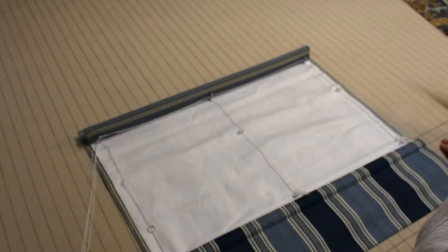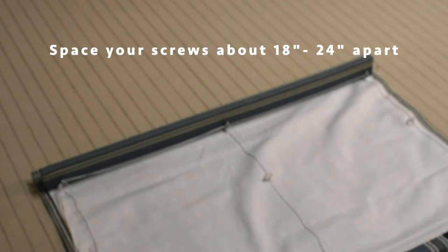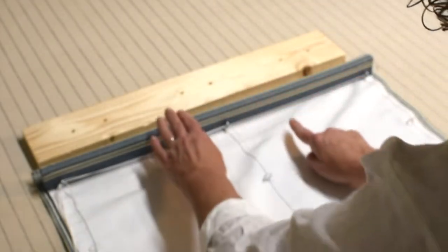Now if you're going to inside mount your shade, this is the easiest installation that you can do. Here's what the back of your shade should look like. We're going to be putting screws through the board right up into the top of your window frame. In order to do that, the first thing you have to do is pre-drill some holes. Because we're going into wood in this type of application, the location of the holes doesn't matter in terms of hitting a stud since the whole thing is going to be wood. But you do want to be careful that you're not too close to your screw eyes. On a short shade like this, I might put one screw about here and one screw about here — that will give the board plenty of support. If you have a longer board, you may want to go closer to each end and then somewhere near the middle.